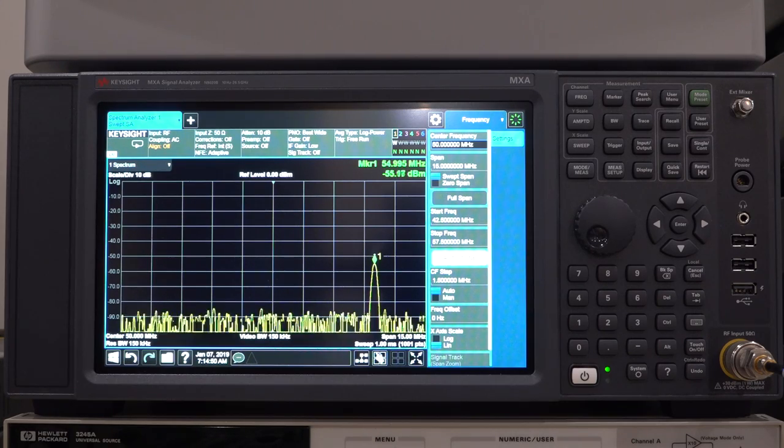Turning this off, I'm going to turn the calibration signal on — the 50 MHz calibration signal — and there's our 50 MHz calibration signal at minus 25 dBm, so that's also correct. Let me turn this back off and go ahead and apply 2 dB attenuation. This front end has only two 2 dB attenuation sections, so we should get at most 4 dB. Let's try 2 dB — whoa, that's bad! We're getting minus 55. So yes, the front end attenuator is not working — as soon as the 2 dB is kicked in we're down to minus 55 dBm, so no wonder we cannot do any alignment.